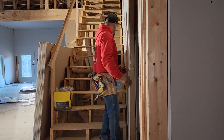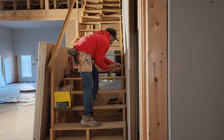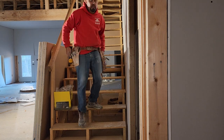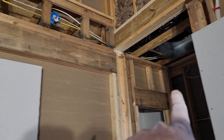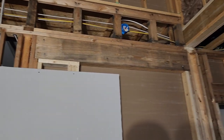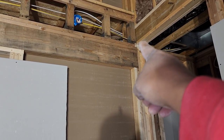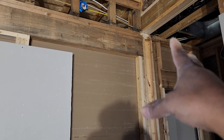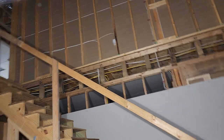Now let's hang the board on the bottom. All right, there you go. Now we have to start our wall from the bottom. As you can see, I have to bring one board from all the way from that corner all the way over. I don't think that's a good idea, so I'm gonna do something different — go in an angle from that corner to the corner on the door. Hopefully that joint is not gonna crack in the future, but let's get ready to set our next board.